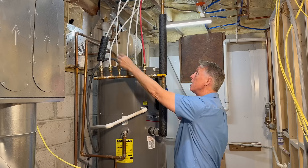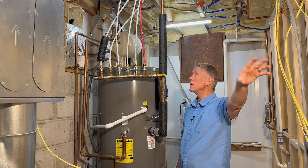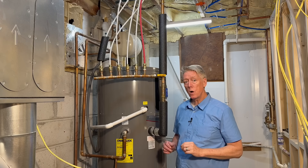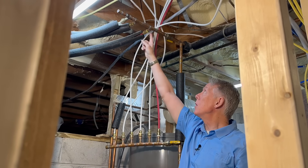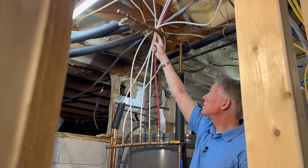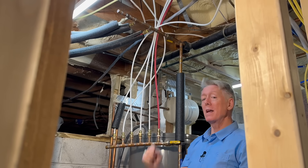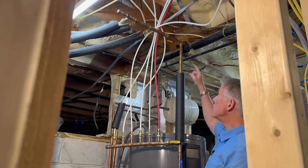Once it gets into the branches, we have very little water because these pipes are so small and the fixtures are all very close. There's the bathroom right here to the left, there's a kitchen right over there, and the farthest one — the red line going to the bathtub — is about 20 to 25 feet. These are all very short, small lines, so not much water has to be pushed through. When I made my first manifold two years ago — which is up right here, going to the kitchen, lavatory, and shower upstairs — I put the manifold up high. Notice also that there's more space between the takeoffs for the three branches. That manifold is a tiny bit longer than the new one, yet it only has half the number of fixtures, meaning it has more water to push through the line.